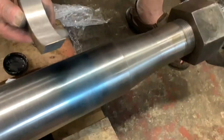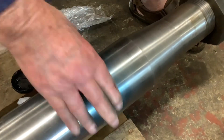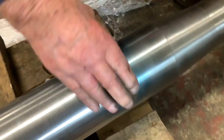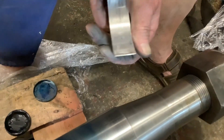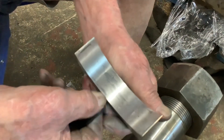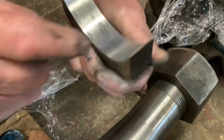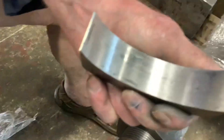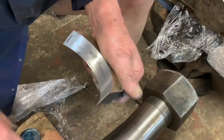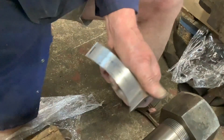So now you're just going to do a repeat of the process you did before? Just put that on there. Now I can see we've got some even better marks. What do you mean by better marks? Well, we've got a heavy mark here, there, high spots, high spot there, one up there still, one there, and one up there. So we're getting close. I reckon we're talking microns — it's so clear, it's amazing.